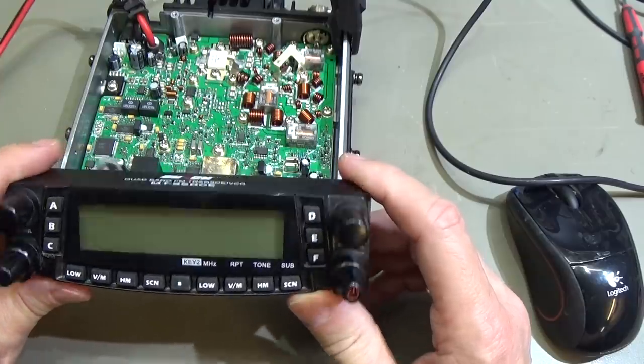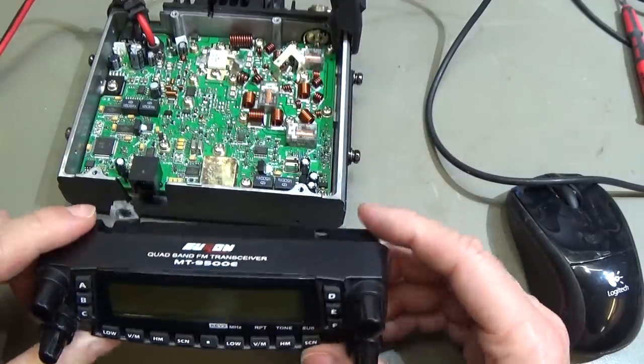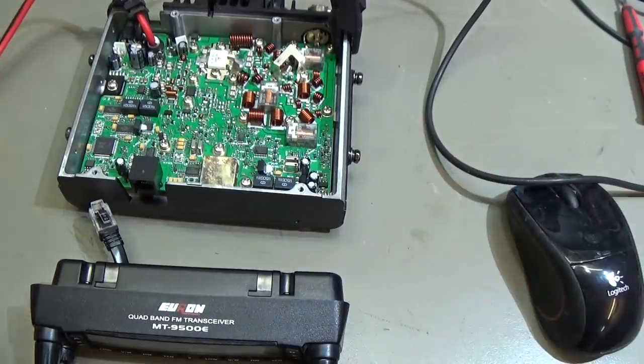That is one point. Additional to that, not only do we need a voltage at our user panel, we need a voltage which, again, is a kind of standby, independent of whether the radio is switched on or off. So that might be our first step, to look at how it hangs together. Let's analyze our circuitry to understand how it works, and then we should be able to go down to the circuit and take some measurements.